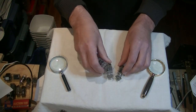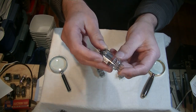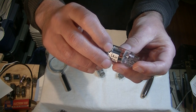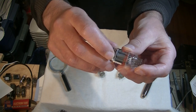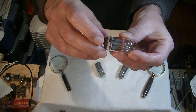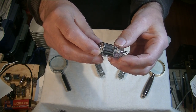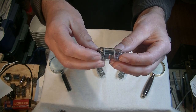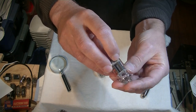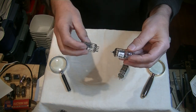Here are some small signal tubes. Here's the Sylvania — it's a 12AX7. Plates are king. I call this a gray corrugated plate. Notice it's got six small slits — six small rivets. Because there's a matched pair, this is a 12AX7, a dual triode — two identical plates inside. The only thing we have on here is a little etched ECC83, which is the European designation of a 12AX7.